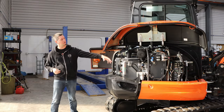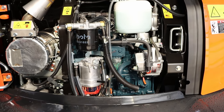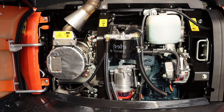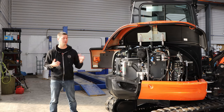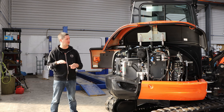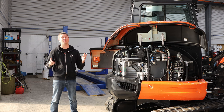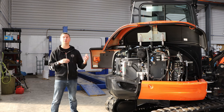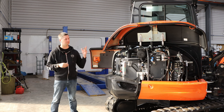Moving around to the back, you'll see the hydraulic system and the engine. There's a lot going on — limited space with lots of things moving and flowing. The engine is 40 horsepower — it's a Kubota engine. All your daily check items, whether it's fluid levels or oil levels, are very easy to find; you don't want to be removing panels every day. Same with greasing — there are ports at the front to make life easy. On the hydraulic system, there are 75 liters in there, so if you blow a hose, there's going to be a lot of oil coming out. It's 17 gallons per minute of flow out to the front auxiliaries, and the total flow before the auxiliaries is approximately 21–22 gallons per minute. Lots of oil going lots of places very quickly.